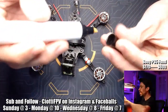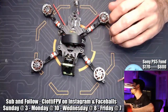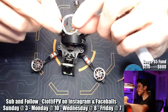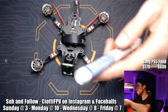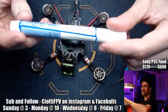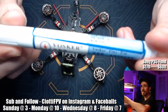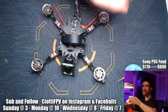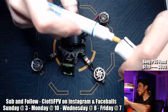It's not even so much about getting better quality work, because you can get good quality solder joints by just using the flux that's in the core of your solder. But having a little bit of extra flux on there, it just makes your life so much easier. It really does. It really makes a big deal. This is the one that I used that came with the FPV crate. It says Yasker on it, and it worked totally fine, but it ran out really fast. This guy is empty now, and it's not refillable. It doesn't have the same seam here so that I can open it up and refill it.